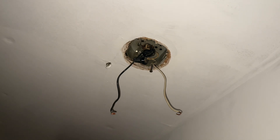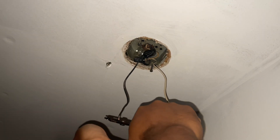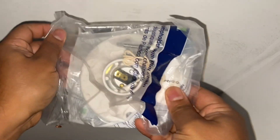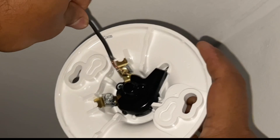I'm going to put it back exactly how I found it. What I want to do is fix these wires. You see it was originally installed with the wire going around the screw. So I'm just going to cut it off just a bit because I don't need it that long to slide it right into this new fixture. I'm going to do this for both the black wire and the white wire.